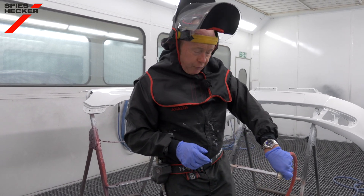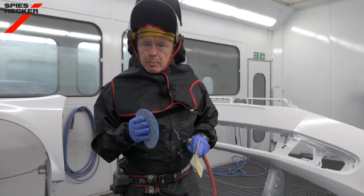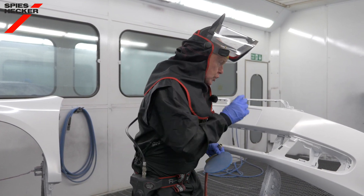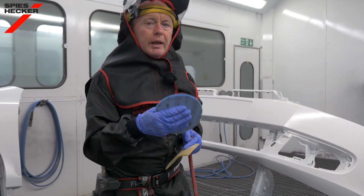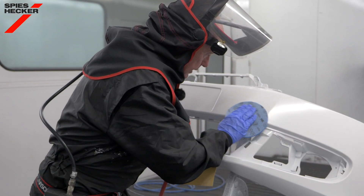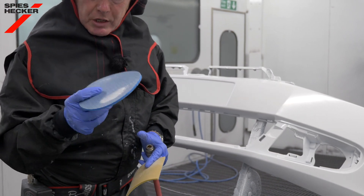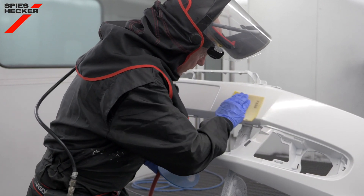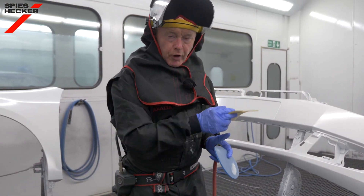It's 24 minutes past 2. Let's come back in 5 minutes and see how dry it is and see if we can denib it. It's now 2:29 and it has been 5 minutes. As you can see, I've got some nice powder on my softback sanding sponge here. I'll just take a different type of abrasive which might be a little bit more aggressive — again, no issue with that. So you can rest assured this dries within 5 minutes.